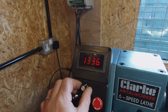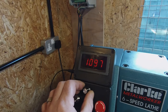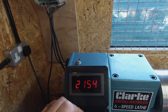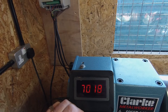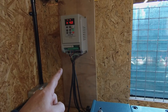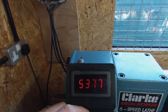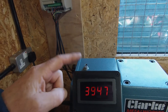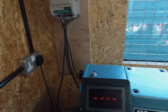That is definitely - that is probably about right, 1336 maybe. A little bit of spray off - this chucks off spray with oil. You see that keeps happening - it's a bit jumpy. I'm sure that's the inverter giving out some EMI and interfering with this. I might be able to get round it by putting some aluminium tape inside this box - that might be one thing.